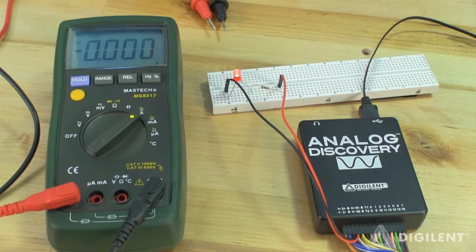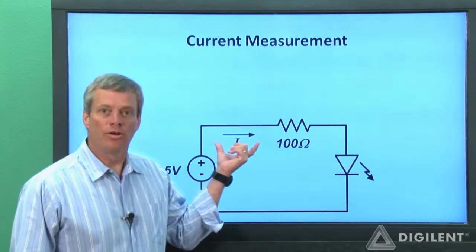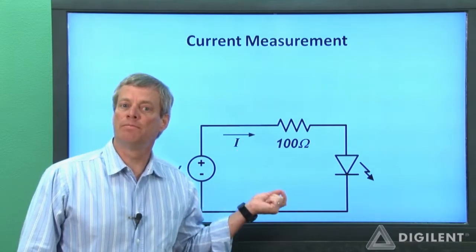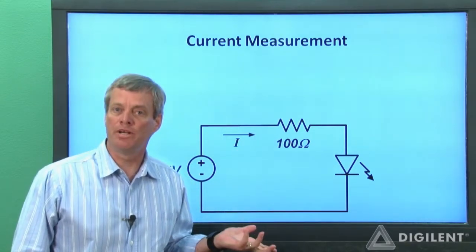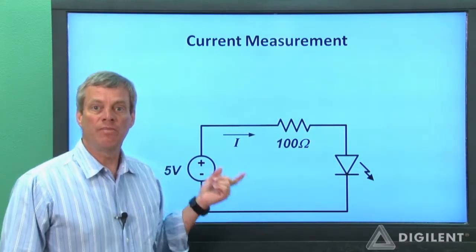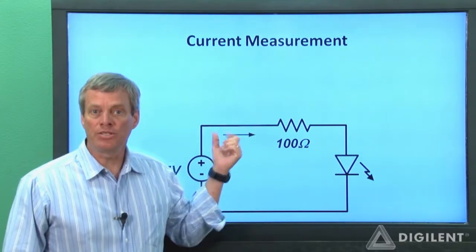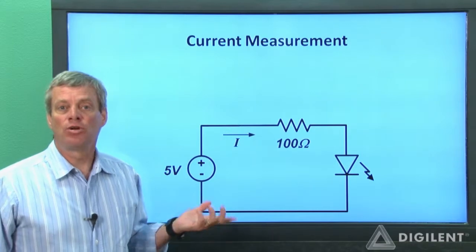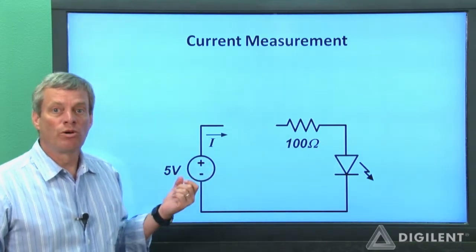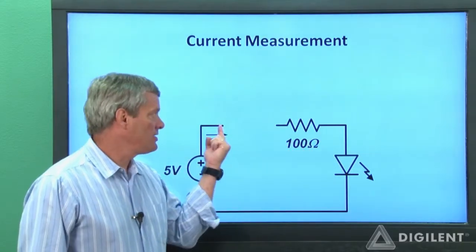The circuit itself also needs to be set up to measure a current. We need to connect the ammeter to the circuit so that all the current which is to be measured passes through the ammeter. Let's say that we want to measure the current through the circuit that we used in our first DMM tutorial, the one on voltage measurement. An ammeter measures the current that passes through it, so we must make sure that it passes through the DMM. To do this, we need to break open the circuit and place the ammeter probes in series with the source. So we're going to disconnect the voltage supply from our resistor and put the ammeter probes at these two connections.